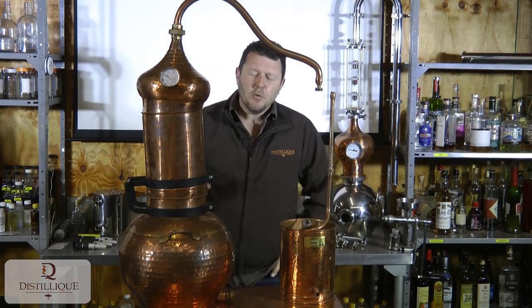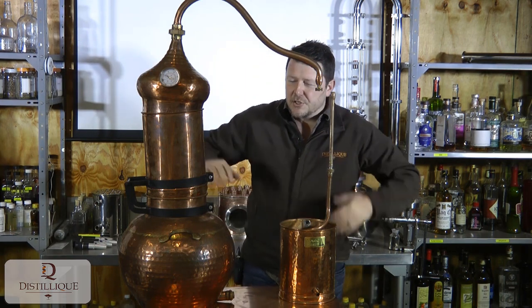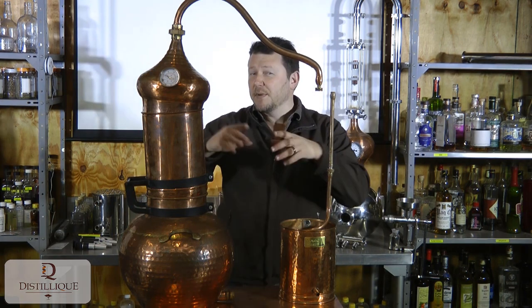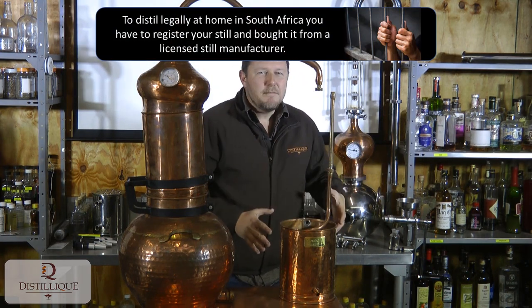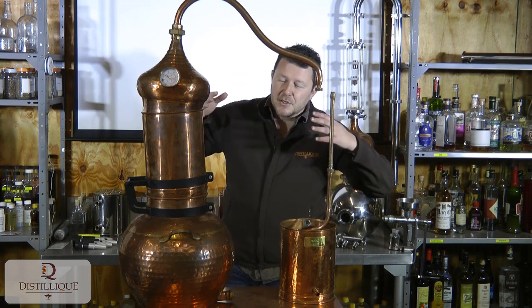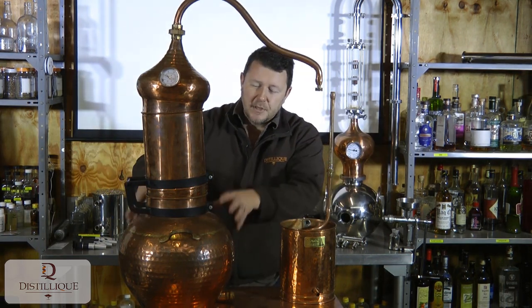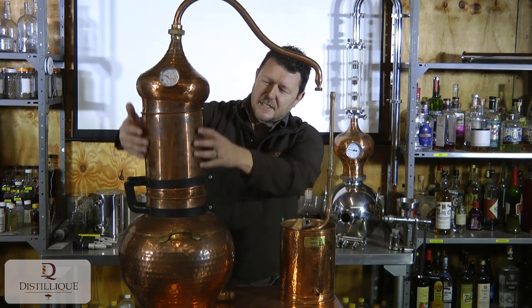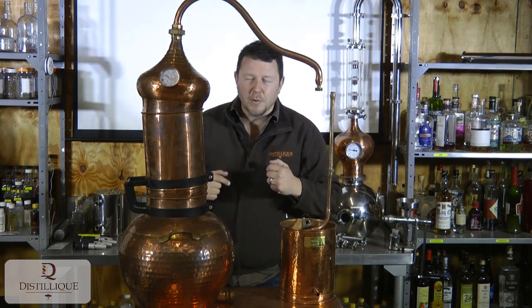Now, the essential oil stills are very, very versatile. Yes, the intended use is the extraction of essential oils. So you put your solvent at the bottom. Now, solvent, please note, in terms of essential oils, doesn't necessarily mean alcohol or hexane or something like that. In terms of essential oils, water is also considered a solvent. So we put our water or our alcohol or solvent at the bottom. Then here in the botanical chamber, we put our botanicals, lavender, rosemary, depending on what oil you want to extract.